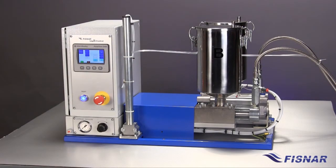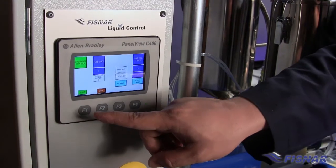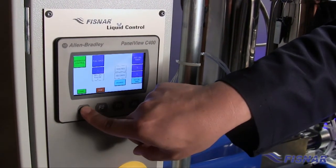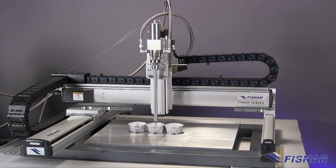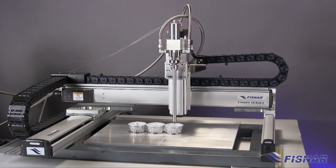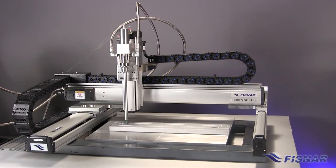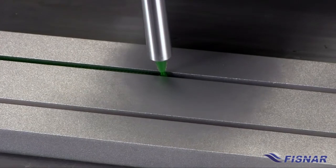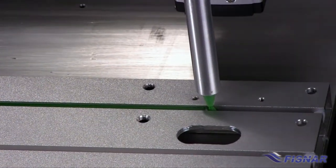The digital logic is programmed to accept commands from the robot. Dispensing a shot is controlled by the LC120FR when the robot is in position and the dispense command is sent. The shot output is adjusted by a sensor, which sets the forward stroke of the metering pumps. Here we are demonstrating the robot dispensing a shot output on command from the LC120FR. Form-in-place beads and seals will be controlled by the robot, with the robot program adjusting the dispensing speed as necessary. The system is now ready for production.